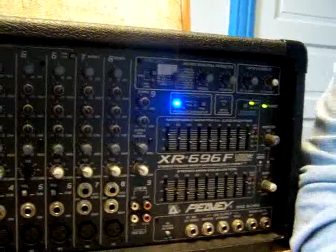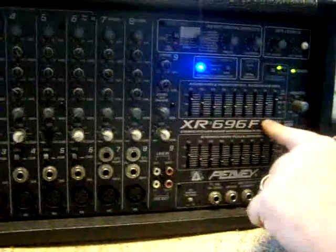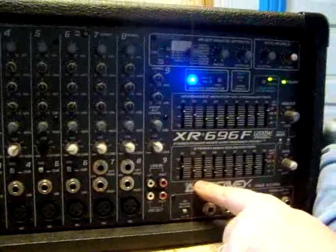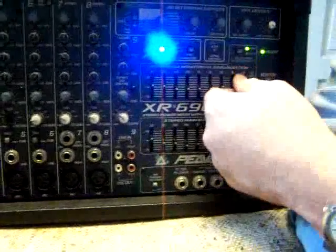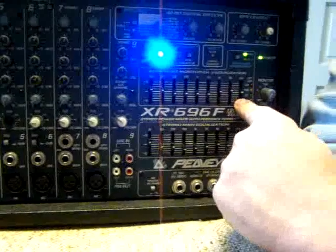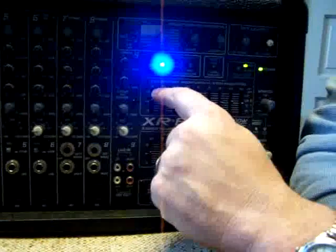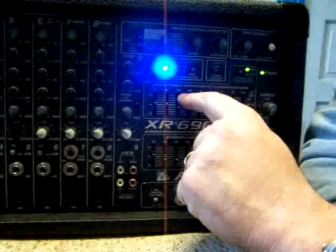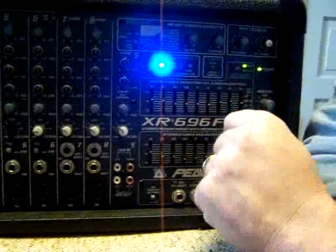The way the mains and monitor work, this unit has two amplifiers in it — that's why we have two equalizers. An equalizer is another tone control. From left to right, it controls the low sound to the high sound. You can see the numbers: this stands for 63 hertz, which controls something that vibrates at 63 hertz. This is 125, 250 — as the numbers go up, the sound gets higher.